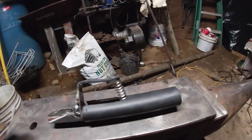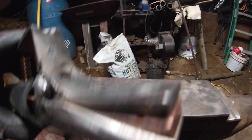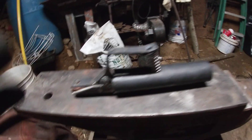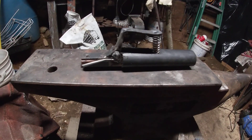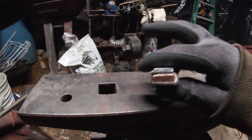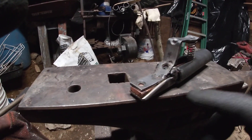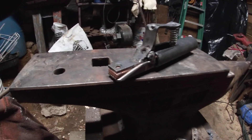Being the kind of guy I am, I broke down and started going through my scrap pile. I had a half-inch round piece of copper which I used for the bottom jaw — it's solid copper, not copper plated. It's sitting on an anvil because I do blacksmithing, so I hammered that flat to a little over a quarter inch thick. Then I took two pieces of angle iron and welded them together.